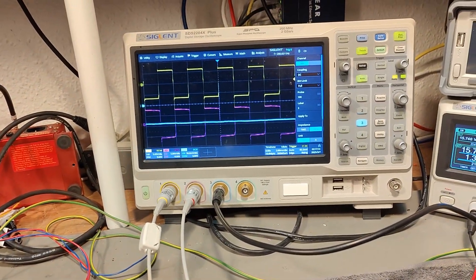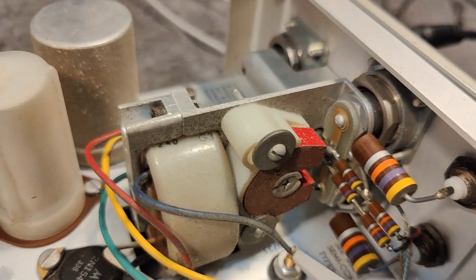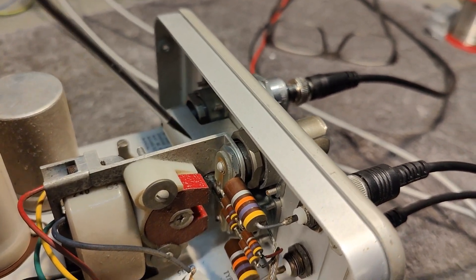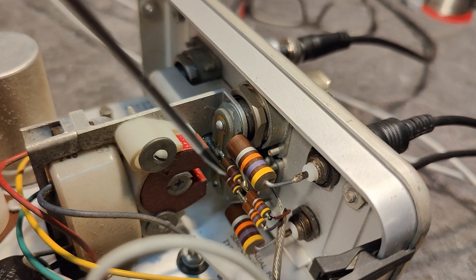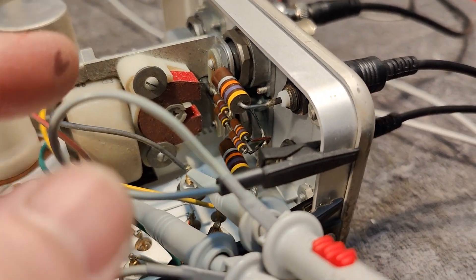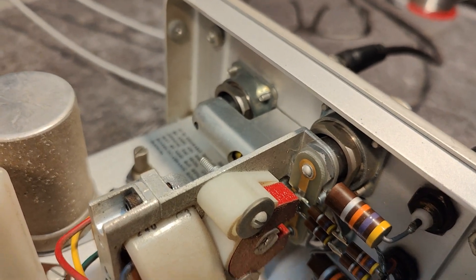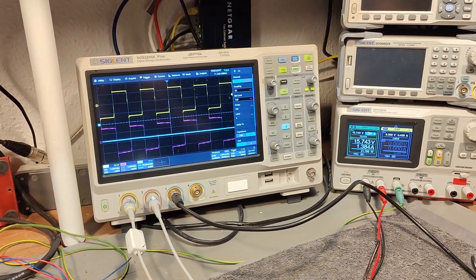There's no response whatsoever, so I am now forced to completely disassemble this whole thing and see if we can get into this little mercury switch. Luckily I found the manual as well — in the manual they say how to exchange the mercury switch using those two screws. First I need to remove the magnet; I didn't really understand what the magnet is good for. Let's try to pull this mercury switch out, because so far nothing really works, but we've got the oscillator running at least.